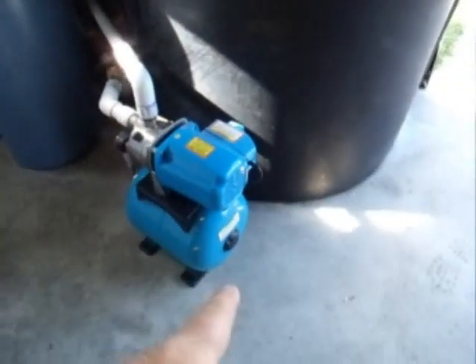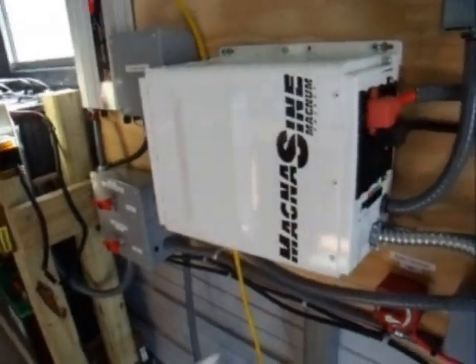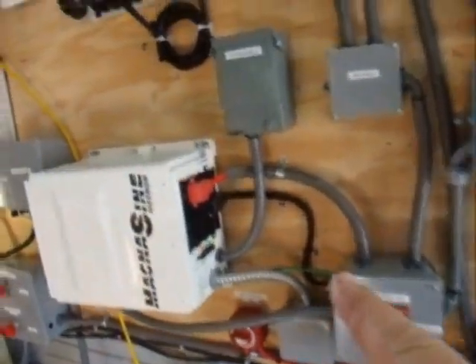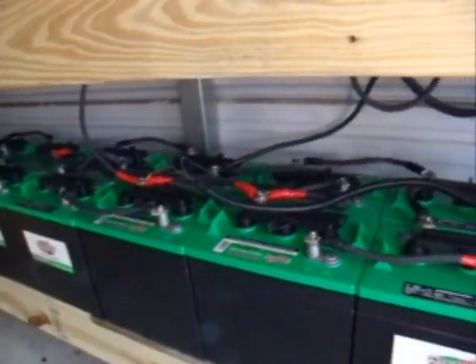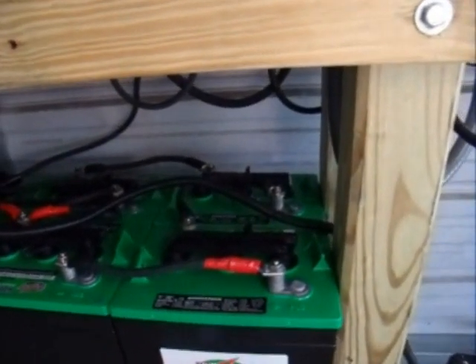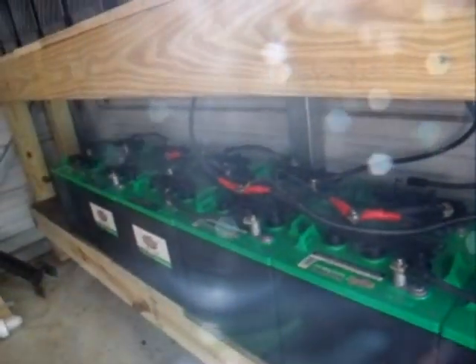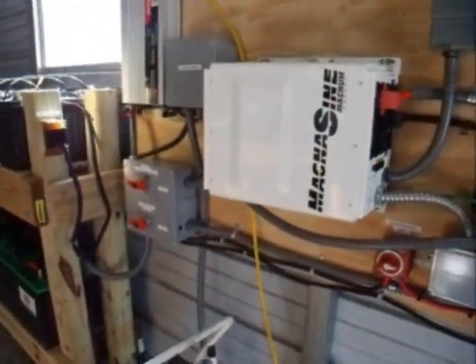Eventually they're going to drive the water pump to the house, which feeds the pressure to our house, and then the well pump as well from that system. That's why that 240 inverter is there — it's for the well pump. This one here is the MagnaSine — that's a 24-volt circuit — and it's going to feed power to the house through this AC disconnect. I've also added a 24-volt battery bank made up of 12 deep cycle batteries — about 2,800 amp hours of stored energy, about 17,000 watts.